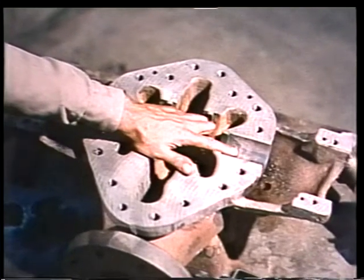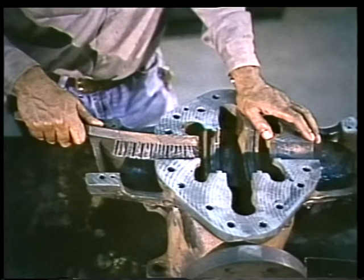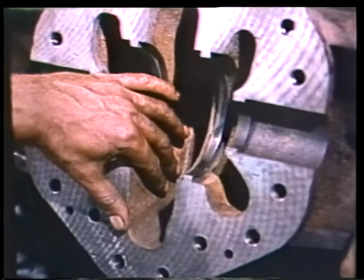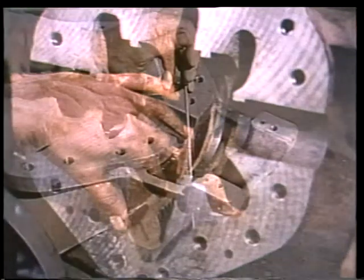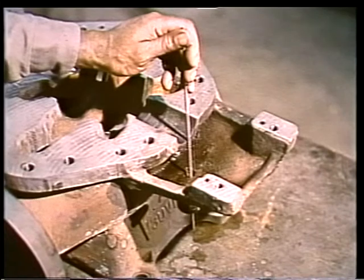The inside surfaces should be clean and smooth. If necessary, use a wire brush to clean the walls of the stuffing box down to bare metal. Another thing to check is the inside surface of the volute. Be sure there are no signs of cavitation or other damage. Then, insert a wire into the slop drain holes and any drain piping to be certain that these flow paths are open.